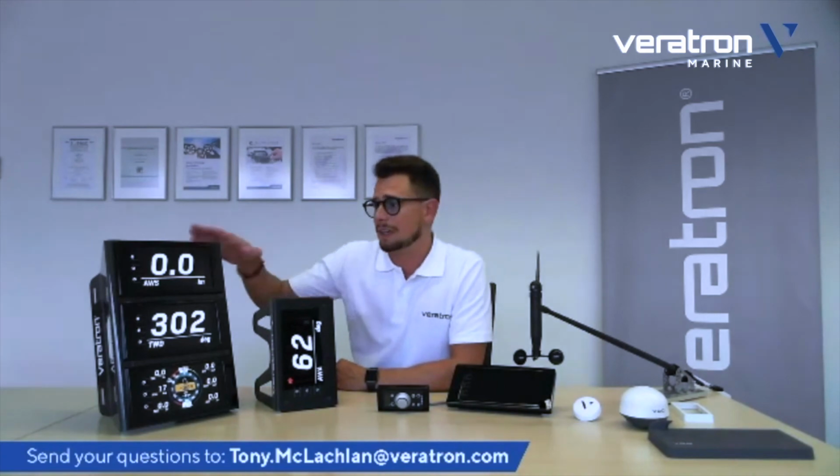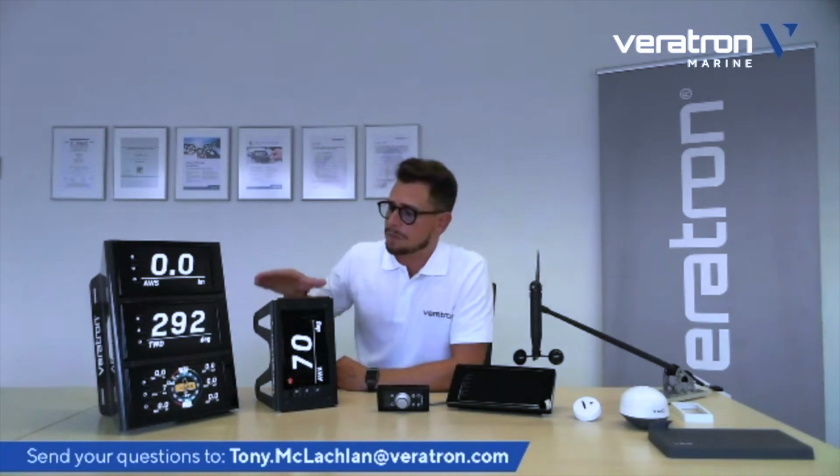I think additionally, we have in the box also a T connection just to integrate into your NMEA 2000 network, and an optional termination resistor that you might need according to your NMEA 2000 network design. So the same, of course, applies for this one, for the triple one. Of course, in these cases we offer this as a kit, but we offer also the bracket as a spare part. So if you purchase the entire Mast Display unit, you will get the whole unit like this, as you see it. But of course, the bracket is also available as a spare part to be ordered. And in that case, you will have accompanying the back cover, all the screws, and all you need to mount the bracket. But this is another case.